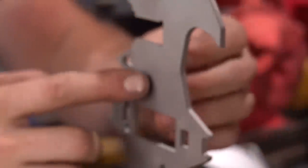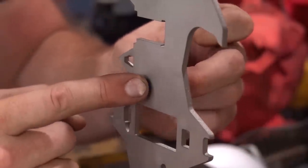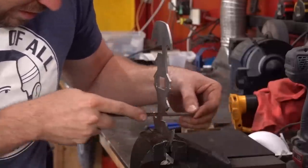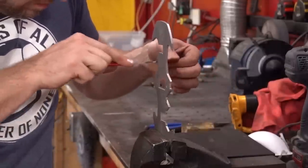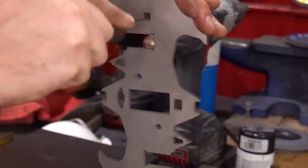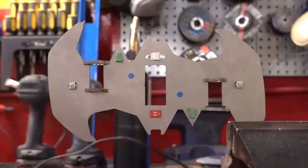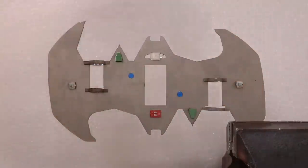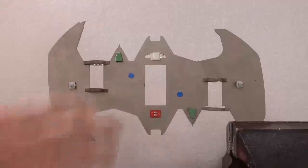The holes were set to five millimeters — that's what I got. On the other side, only a quarter of a millimeter short, so I have very, very little filing to do to make it exactly perfect. A five millimeter LED fits like a glove with just a tiny bit of filing. All of the bits fit now — plug, wire things, momentary switches, LEDs on and off. Everything fits.